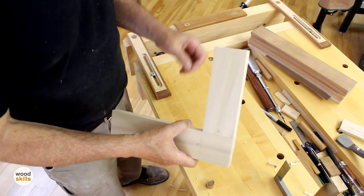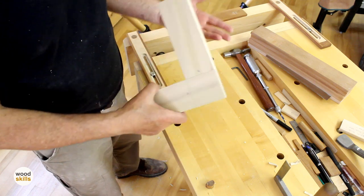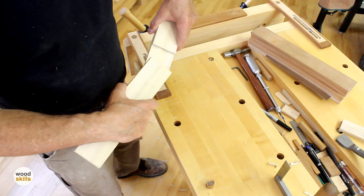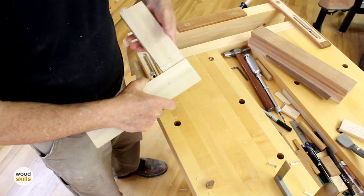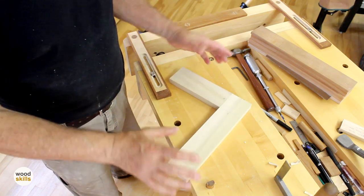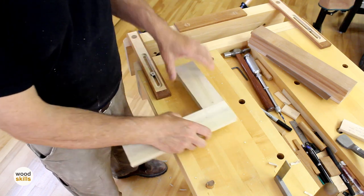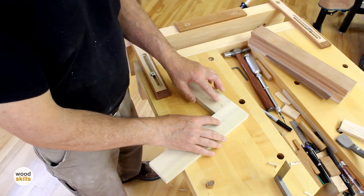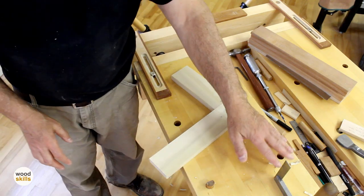It does really depend on the kerf of your saw. In this case, I use a Ryoba, which probably has one of the absolute thinnest kerfs you could possibly have on a cross cutter or a rip saw. So that makes a difference. And the technique also. It's a fairly, not overly tight, but tight enough joint. So it just needs a little glue and it's all set. Of course everything lines up here. I'll mark everything because I have several of these joints I've been working at lately, so I like to mark them so I know they're a sort of match set.